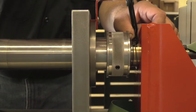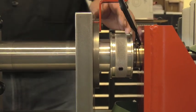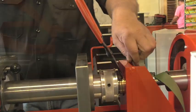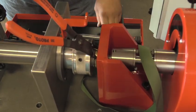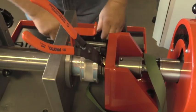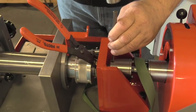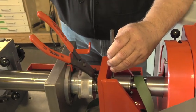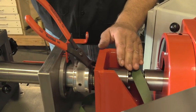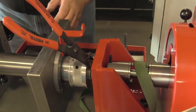I like to leave the snap ring pliers on the snap ring and leave it in place for future assembly. Now that we have that done, we need to remove the set screws on our drive shaft coupler. There is one on each side of the coupler. Now that we have the set screws out, there is a quarter inch roll pin inside there. We need to drive that most of the way out. Now that we have our roll pin loose, we can slide our socket chuck out.